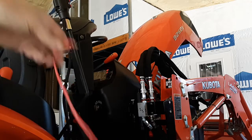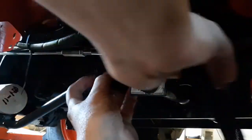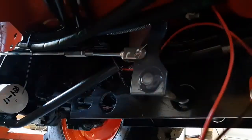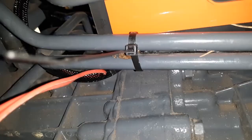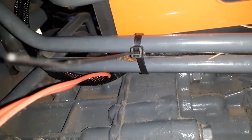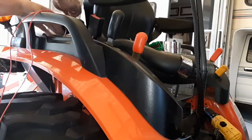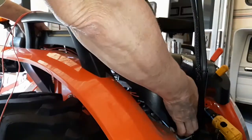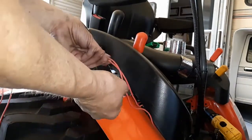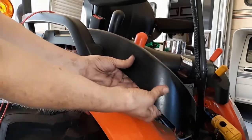The nice part is this valve was working. Because there was no grapple, it wasn't going to test the hose lines going to the front grapple. Black wires go to the forward valve, red wires go to the back. But it would complete the circuit, so I could verify under my seat there was no leaks there. Where the tire was going to go back on, where I had to tap in there with the other elbow, there were no leaks. And mind you, both of those elbows were 2 different sizes. So there was no putting parts on where they did not belong. It actually was pretty ingenious the way that was set up as far as that goes.